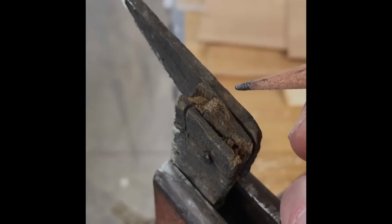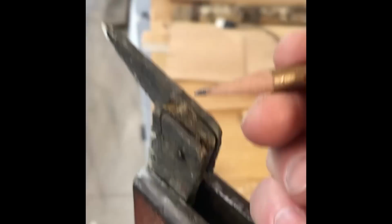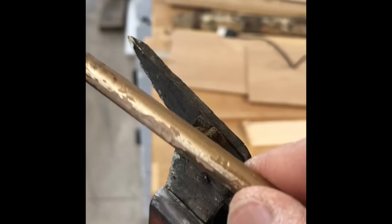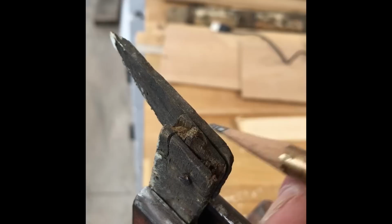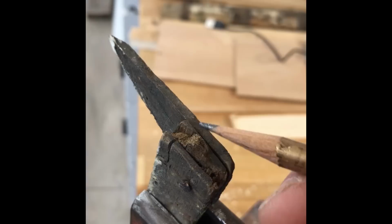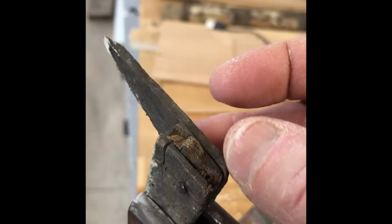All right, I wanted to point out how the stem inwale connection was made, at least on this Indian Girl. The end of the stem has a tenon that was cut onto the top of the stem, and then the two inwales would come across and capture that tenon in little mortises, half a mortise on each inwale. You can see here the remnants of the tenon that would have stuck up. It was made in the same profile as the stem itself. It was just cut along the sides for the two inwales. This is a little piece of planking that's still left on here.